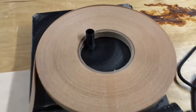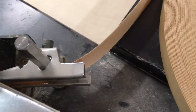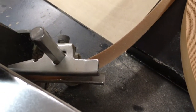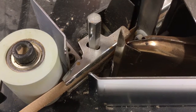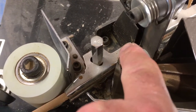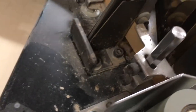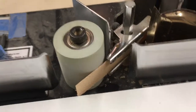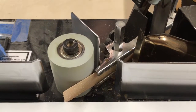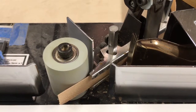Back here is the table that the edge band roll sits on, and the tape is fed into these guides. You'll notice those guides at the back and then there's a set of guides here at the front. This deflector here blows the heat right onto the tape. These guides can be adjusted — you just loosen those cap screws on the back and you can move them up and down. Once you get it adjusted it's set; I haven't had to move it in three years.